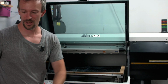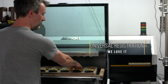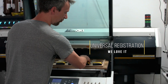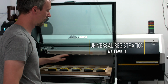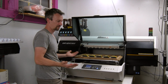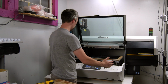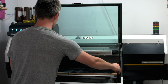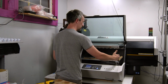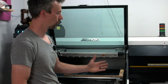So when we're ready to put a jig there, we just set it on the table, bring it down to this surface, and then put it right into the corner. So everything is registered to the bottom right-hand side, and that works basically for all of our jigs. What I've seen is jigs set up with pins, so you always have to try to line up to the pinholes that you can't see and slam it in there. But this setup really works well for us.